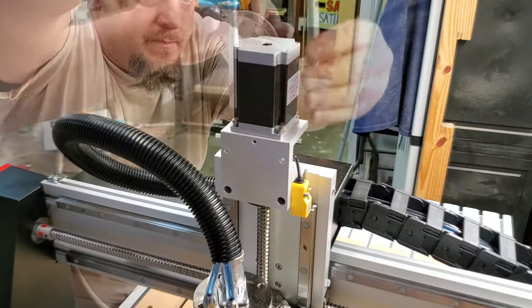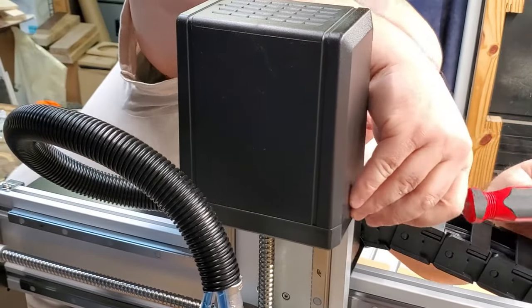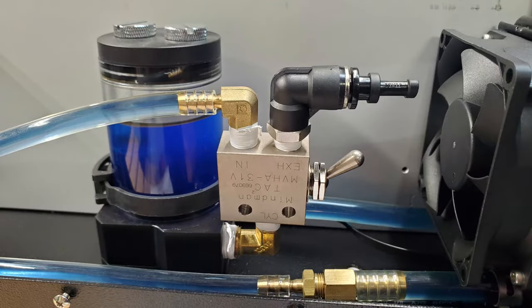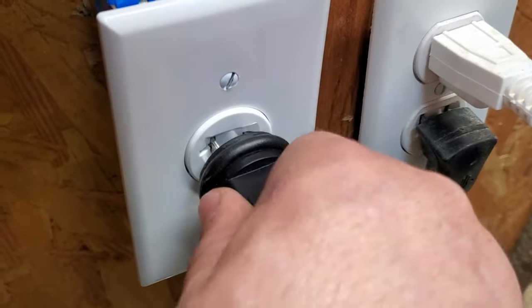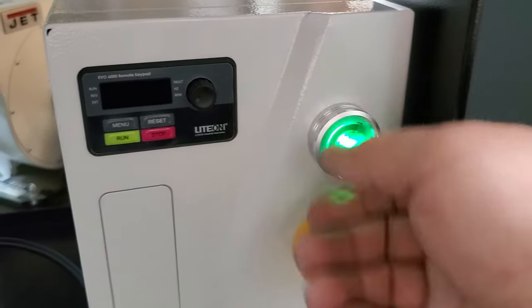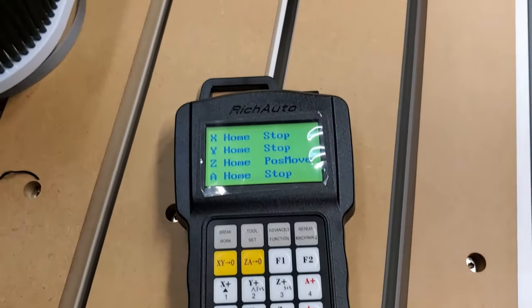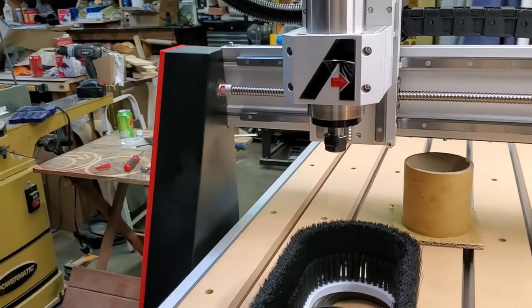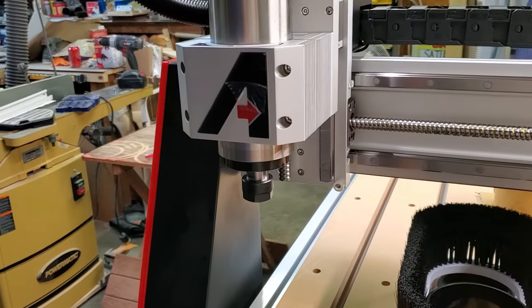I found a long screwdriver to get those the bulk of the way in. Put the housing back on top, and check out that water pump — built-in water pump and reservoir, which is amazing. That's really what drives that water-cooled spindle. No bucket needed. Plug it in, turn it on, and we have power. That's the home screen. Every time you turn it on, it will ask you to home all — do that. Once it homes, that's a reference point so it knows it's at its far front and left position, which makes everything easy to orient for the rest of your jobs.